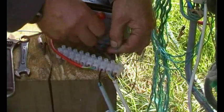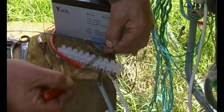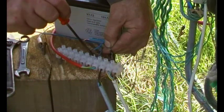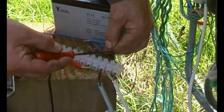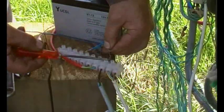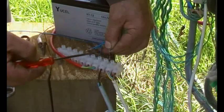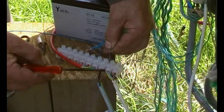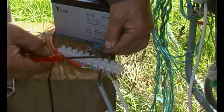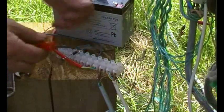You would also have a diode between the other micro switch, oriented the other way round. When you make the motor go backwards you turn the polarity around, so what was positive becomes negative and what was negative becomes positive. You use these diodes as a switch — effectively, one way round, a certain micro switch is allowed to be used. The diode allows power through, but when you turn the polarity round for the motor to go backwards, that diode stops the power going through, and the other diode lets it through.